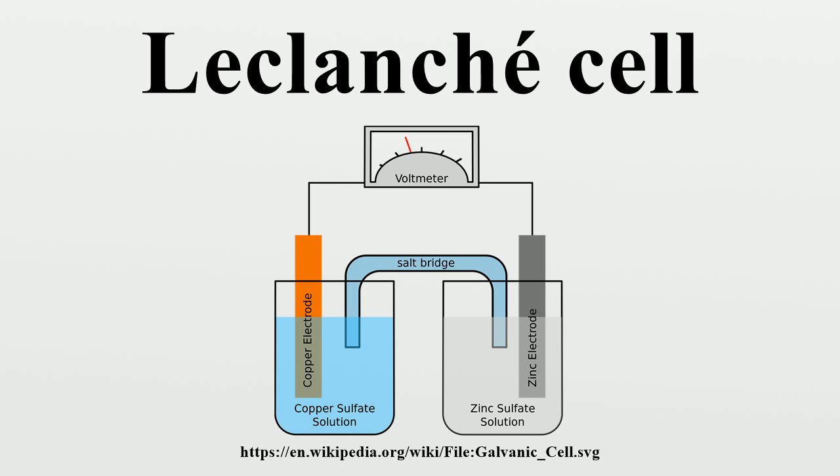After passing through the whole circuit, when the electrons enter the cathode, they combine with manganese dioxide and water, which react with each other to produce manganese oxide and negatively charged hydroxide ions. This is accompanied by a secondary reaction in which the negative hydroxide ions react with positive ammonium ions in the ammonium chloride electrolyte to produce molecules of ammonia and water. Alternately, the reaction proceeds further, with the hydroxide ions reacting also with the manganese oxide to form manganese hydroxide.